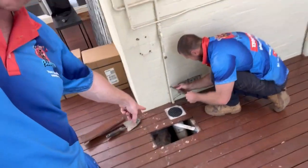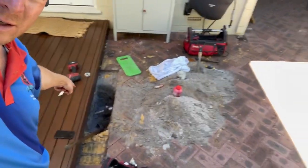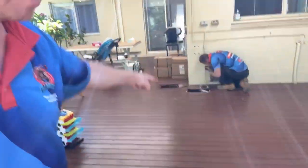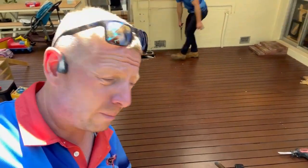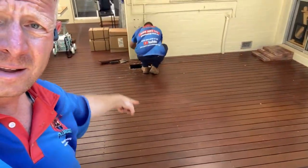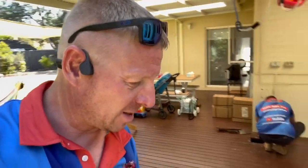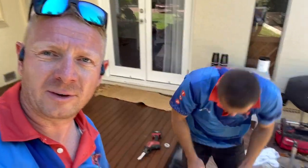We found the leak and it's near the house. Just got Reece here now helping. So what we're going to do is, rather than waste time under the decking — they've had multiple problems here and it's going to be an absolute pig to try and repair a pipe under there — we've quickly found where the pipe is in the ground from the side of the house, the main feed before it goes under the decking. So theoretically, if we cap it here, which we have, and turn it on in a minute and it doesn't leak, then we should be able to re-divert the pipe up the side of the house and feed it back over, which basically totally eliminates the pipe that's been problematic under the decking. That's the plan — re-divert the pipe up the house and around. No more water issues under the deck.